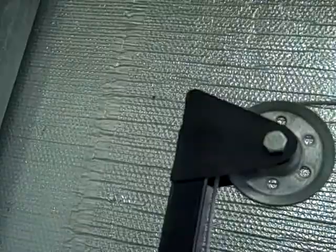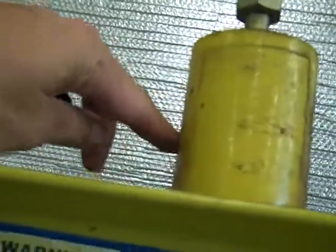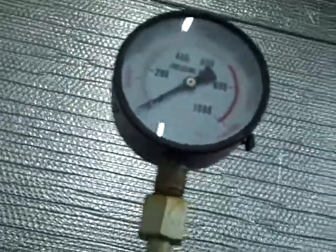The second cable travels just across. I made these extensions here — I had originally had the wheels lowered right here with the cable running around the cylinder. But when I loosened up the cylinder and started moving it so you could line up press work easier, as you got it closer over to one side, the angle became so great it would push the cable off the pulley. So I redid these and raised them up higher so it would clear my pressure gauge.